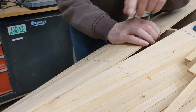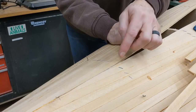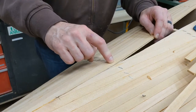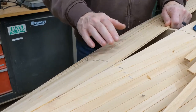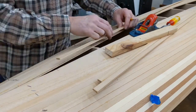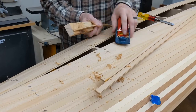You'll notice I've switched over to staples in this section. Remember I said I didn't want staples? Well, they don't make very big holes, I found. But they're also speeding up this process like crazy — and really, I can't even get one of those clamps in here, they just don't fit. So staples are really my only option on some of these. It's speeding it up because I put this one in 10 minutes ago, fit this one, and I can put the next one in 10 minutes later. I'm not waiting for the glue to set every time — some of these were having to sit for almost 24 hours to cure up. I see why the guys do this when they do it professionally.